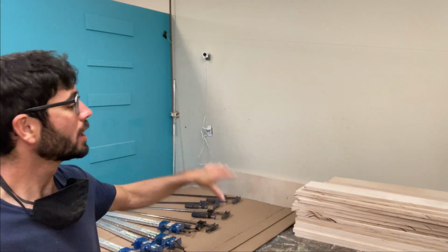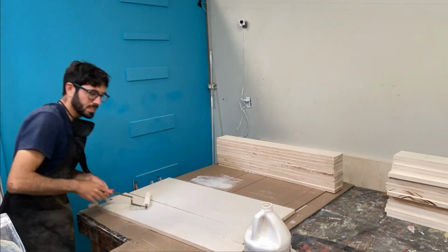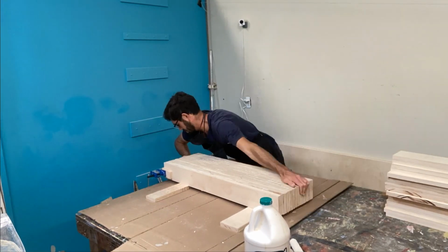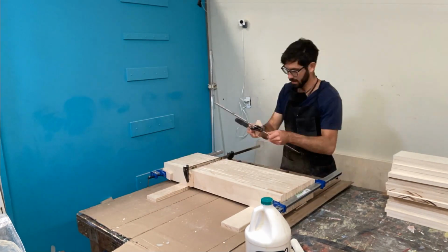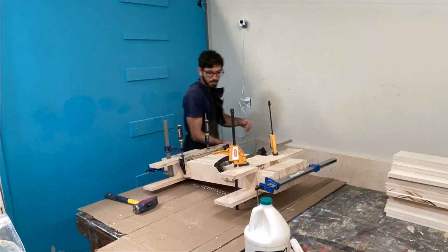And like I said, just checking the dimensions of everything and getting my clamps set up at the correct widths for clamping everything together. The reason I glue up the blocks in the way that I'm gluing them, because you might be wondering why don't you just cut the wood into strips and stack it all horizontally, is because the mold will be stronger under the forces that we're going to be applying to this when the strips are vertically laminated, which is what I'm doing here. It's important for me to give myself a little bit of a buffer in terms of the width of the block, the strips, and the length, because sometimes these shift around, and if I made these the actual height and length of the mold, when I trim everything down and clean it all up, I'd end up with a mold that's slightly smaller than I intended.